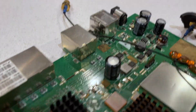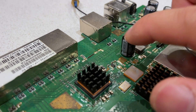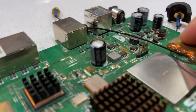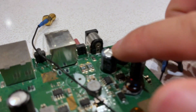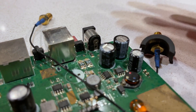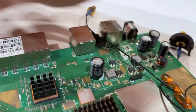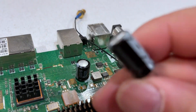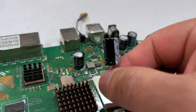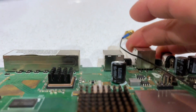This is a common issue amongst electronics. These are what they call aluminum capacitors, and this one right here is bulging — the top is kind of curved upwards. You can compare this to the others. This is what a good capacitor looks like — it's actually curved inward. These are good, and this is the new capacitor that I am replacing the old one with. You can see it's completely flat.